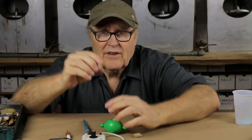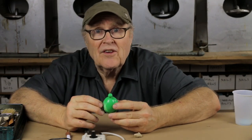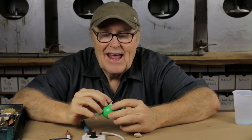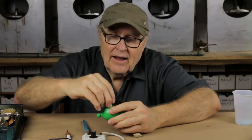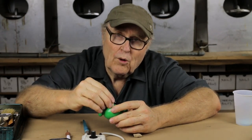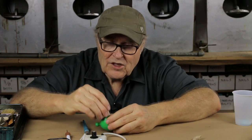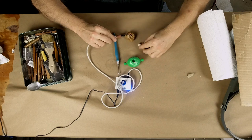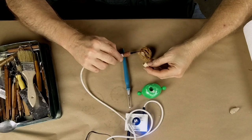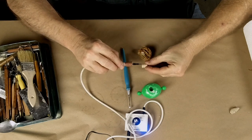On the other side we're going to have a sprue — this is where I'm going to pour the resin in. This is going to be a rotational mold, so we won't need any vents, but we will need a sprue. This little plug is going to form the sprue and also form a plug in the mold when I cast it. Rather than cover it with clay, I think it's going to be much better to wax it in. Let's break out the sticky wax — it's a piece of wood, so the rubber could stick to it, but not if we coat it liberally with wax.